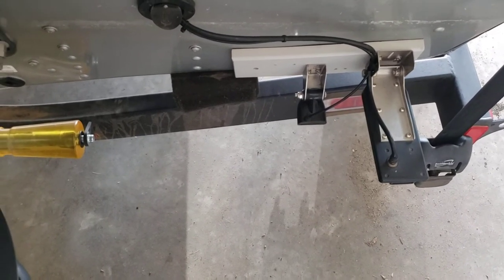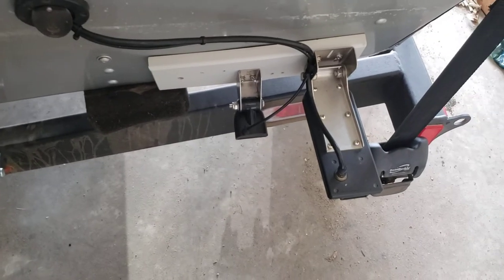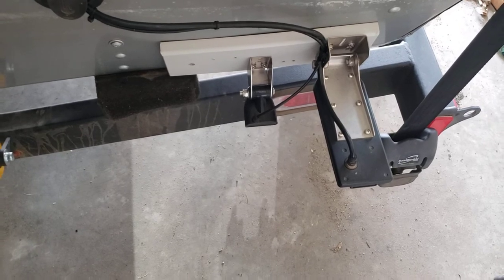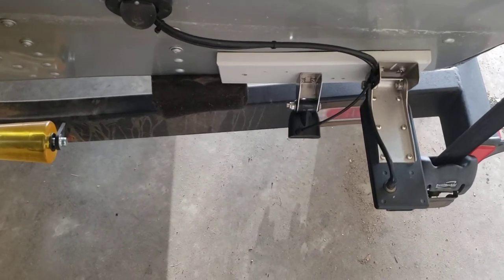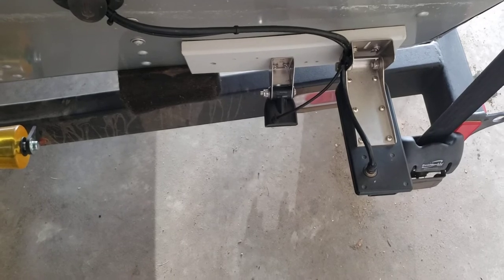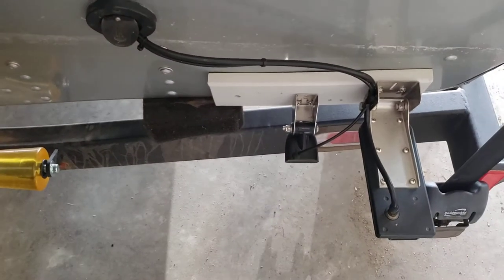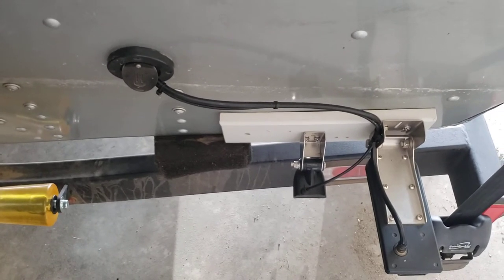My 2D comes from that little 2D skimmer, which is split off using another Y cable — so I've actually got two Y cables in the boat. The down imaging comes from the right-hand transducer, and the left-hand transducer only provides left-hand side imaging. Temperature comes from that little 2D guy as well — I'd have to double-check that, but if it doesn't, then it comes from the right-hand side imaging. So, that's why you want to have multiple transducers on your boat, so the motor doesn't block part of the left-hand beam. If you've only got one, you're supposed to install it on the right-hand, starboard side of the boat, according to Humminbird.